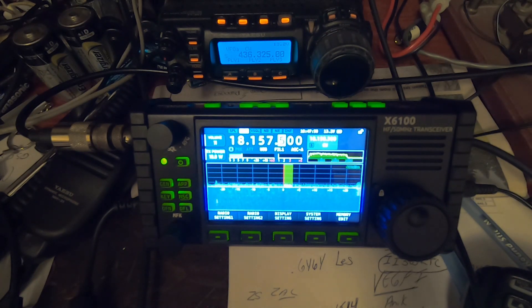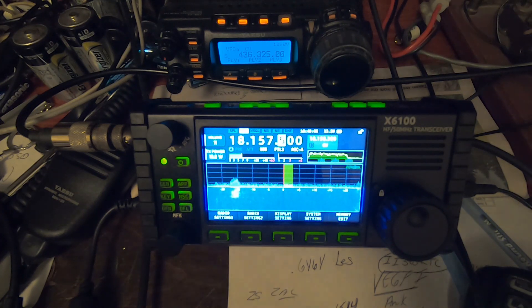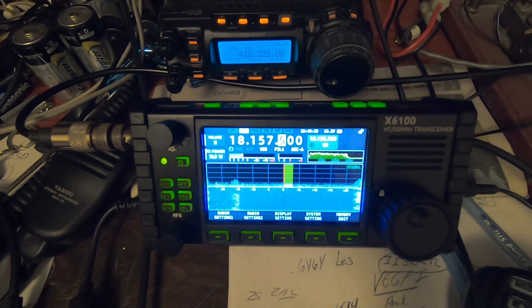I was able to make a contact yesterday on the HF propagation frequency. I worked into California, Montserrat, and a few other places running 10 watts, single sideband. And I did work CW split — transmitting CW — and the receiving stations coming back to me in voice. So I was receiving them on single sideband, and it seemed to work quite well that way as well.